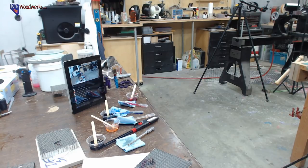It's going to be a little bit harder to nail those exact specific colors. This is where you're going to run into problems. Unless you're very careful about how much dye you added to how much resin, it may be a little bit tough to match the colors again. So I just want to warn you, me changing the amount of resin on this second shot, and I really wasn't paying that much attention to how much dye I put in each one. This is where it really becomes important to keep notes and know exactly what you're doing and use the same amounts for stuff. But we'll just kind of wing it. I think I can get it pretty close on this next one.